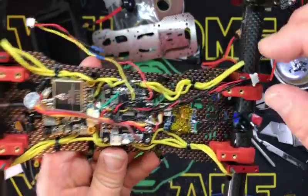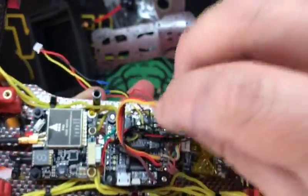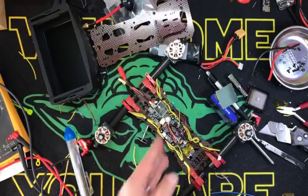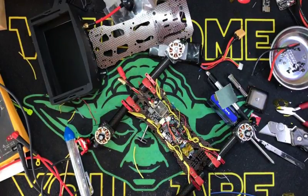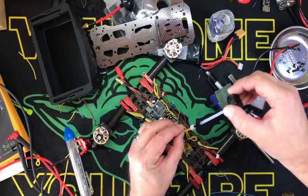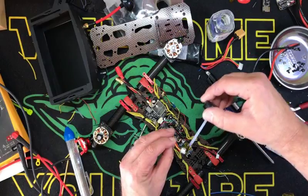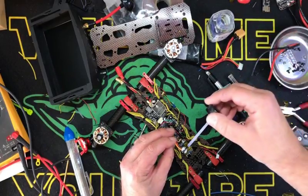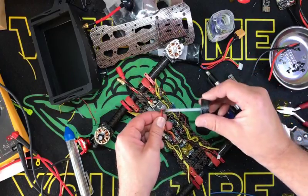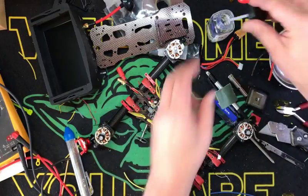And we're back. Very, very simple. There's our little LED and we'll probably just hot glue them, or double-sided tape, whatever. One thing I am going to do is I'm going to conformal coat that LED because we are going to be attaching it to a carbon fiber frame. We don't need a five volt short. You can get it on the LED — it's not going to hurt anything. I'm going to do the back two just for good measure.